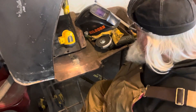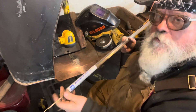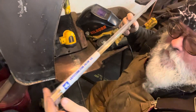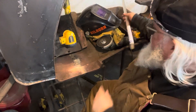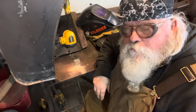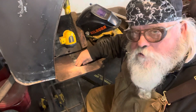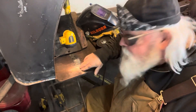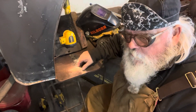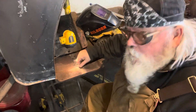This rod I got from my local welding supplier — it's Washington Alloy. It runs about 33 bucks a pound, so it's not inexpensive. I like this better than brazing — it puts less heat into your work and it's cleaner. I've never been a big fan of silicon bronze for cast iron. I know people do it, but for me it's just never been something I'd be willing to try.